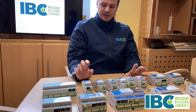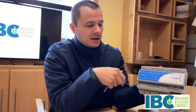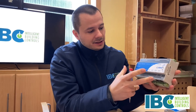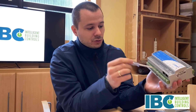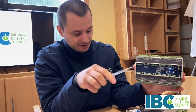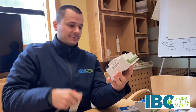That was the mini series. We also have the mixed series: the Mix 18 and the Mix 38. The Mix 38 is a winner on the market compared to other companies, in terms of space saving in your switchboard cabinet — you get 38 physical inputs and outputs in a really small device. This device also communicates through Modbus and BACnet via RS485 or Ethernet IP, and can also work as a Modbus gateway. Under the cover you will find the same things as on the mini series: a DIP switch, rotary switch, and mini USB connection.